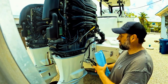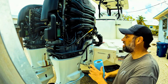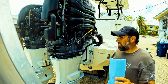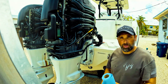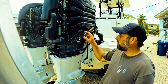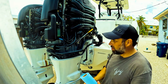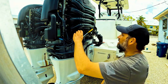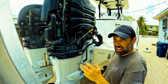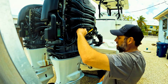Get this oil filter — much easier doing it this way than with the cowling on. I should have done that on the first service. I got a lot of that box spray on the filters. I read an account recently of a guy who was 50 to 60 miles offshore fishing and sprung a hole in the oil filter. These oil filters will rust and corrode if they get salt spray on them, and then you get a pinhole in your filter, lose all your oil, and you're dead in the water. So I'm real cautious with these oil filters.